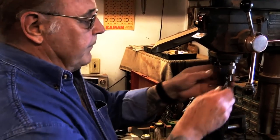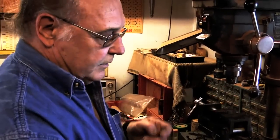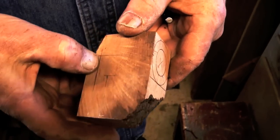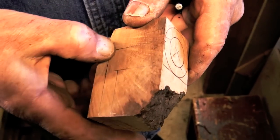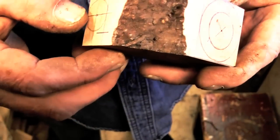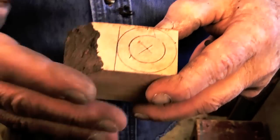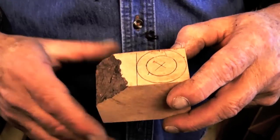This is basically a pipe that's laid out. What you have to do is lay out your draft hole and your tobacco chamber hole. These centers have got to stay true, or your draft hole will get off at the bottom of your pipe. A little bit's acceptable, but... Big pipe, right? Yes, please. Thank you, sir. That would be a good place. Thank you very much, appreciate it.